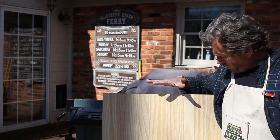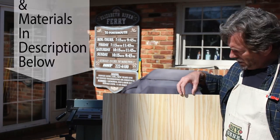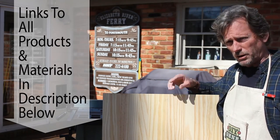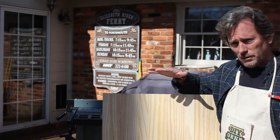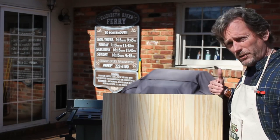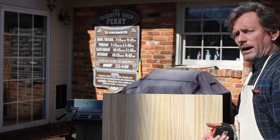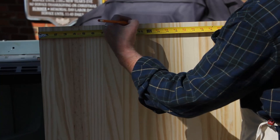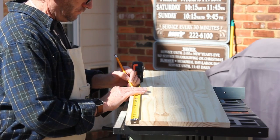The weather is so nice out here today, I decided to move some of the tools outside and do some of the cutting. I'm starting with a board I picked up at Home Depot — a laminated piece of pine or possibly fir; I'll double check and put it in the description below. It's supposed to be 24 by 48, but it's actually only 23 and a quarter on this part. We just need to make sure we split it exactly in the middle, cutting at 11 and 5 eighths inches.